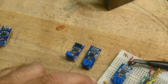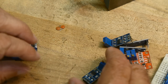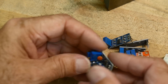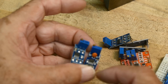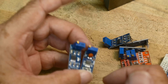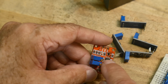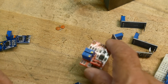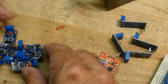So the moral of the story is: check yours if you have any. Check them for this issue. They come in different shapes and sizes. Some have little round ceramic capacitors; some are all surface mount. This one has one through-hole component — and that was this 104 cap, which is what was bad. There's also a variety with jumper blocks where you can change the timing, pulse width modulation, duty factor, and frequency — pretty fancy, but they're big and eat up a lot of breadboard space. If you've got some of these, better go test them. You might not be doing what you think you're doing.